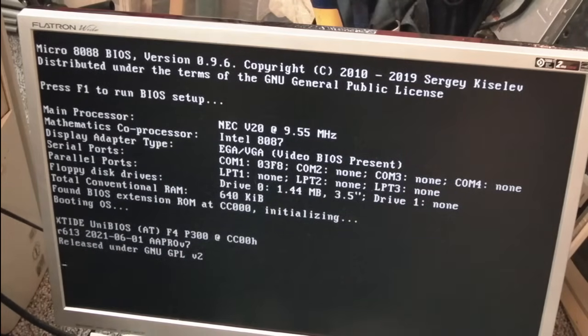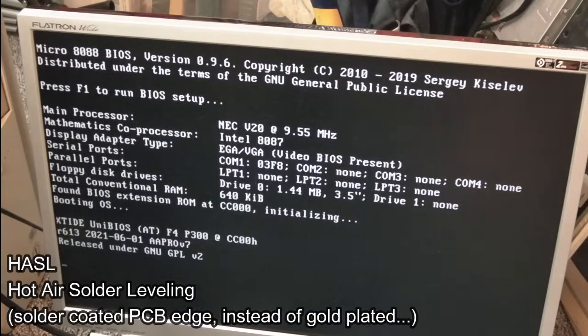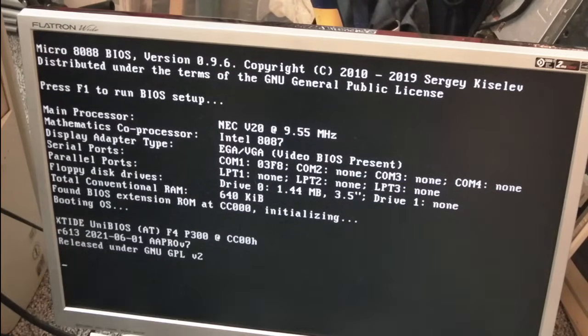Skip the memory test. Oh, hang on, yeah, there we go. So in a different slot, that's actually working, I think. Is it going to boot? And it might not boot properly. I don't know. It seems to have frozen at that point, doesn't it? But you see, the problem with this XT IDE card is it's got edge connections, and I think that's what's going on here. I think the edge connections are making a bad connection. Let's switch it off and on, and I'll plug it in and out again. You want gold plated cards, really.